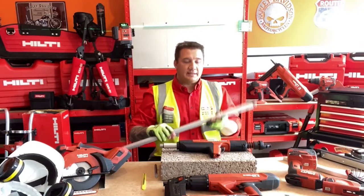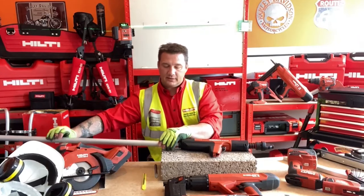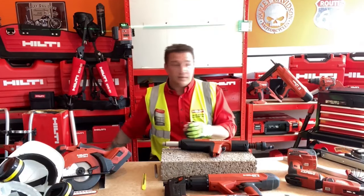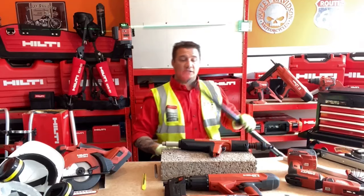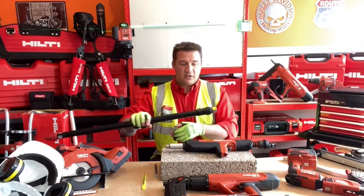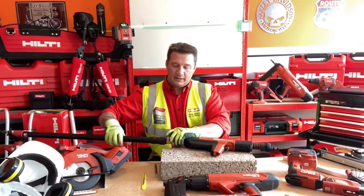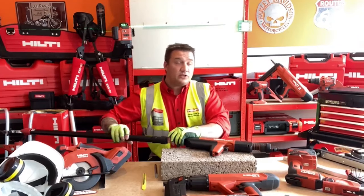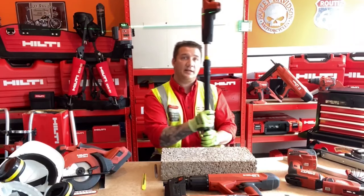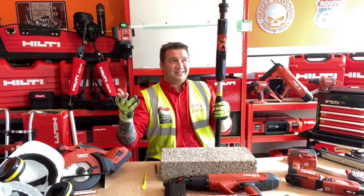This is the CT version — the pole tool version — which gives you as standard four meters of height. You need the middle section that attaches into the back of the tool; it enables the firing mechanism, but I haven't got enough space in my garage so we'll just use the lower section for demonstration purposes. The tool itself is very light at 2.7 kilos, giving you more freedom and flexibility to adjust it when up high. It's very slimline, so since ceilings go in generally after the services, this gives you free access to get in between the services with ease.